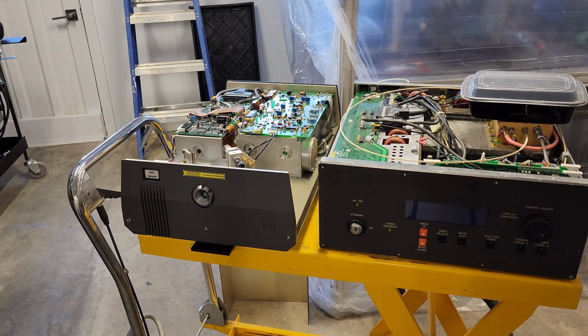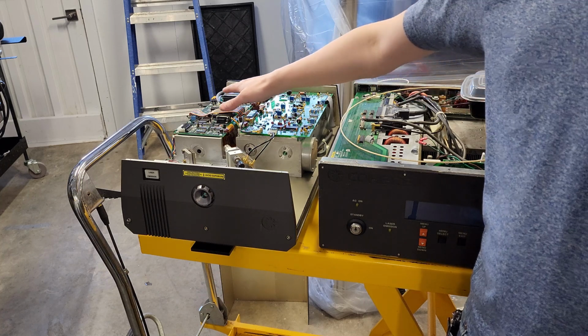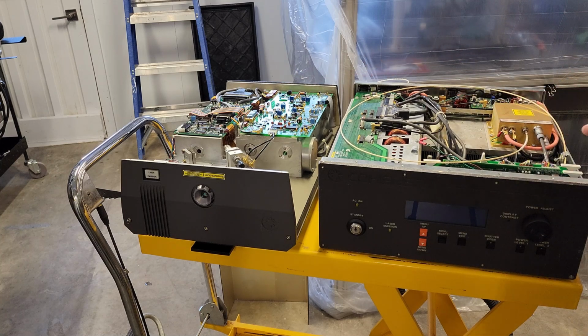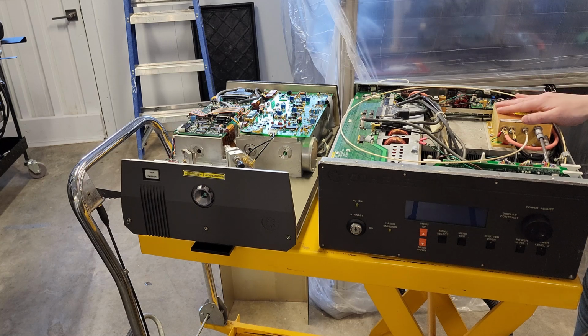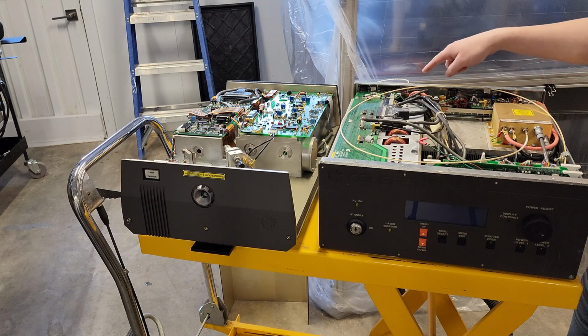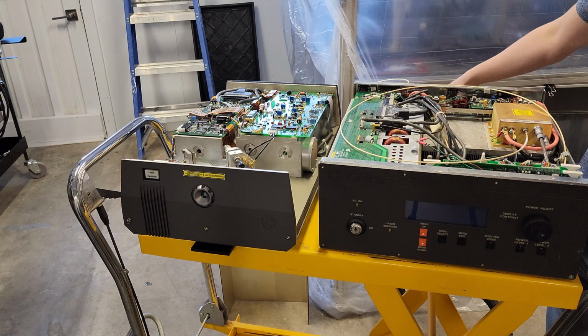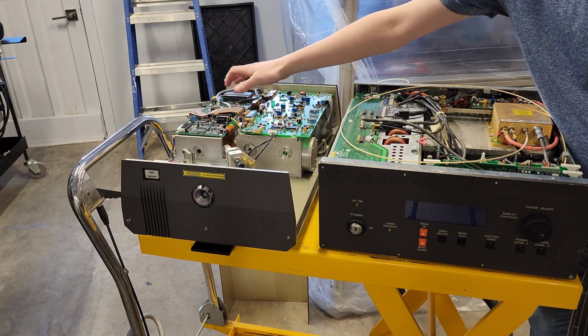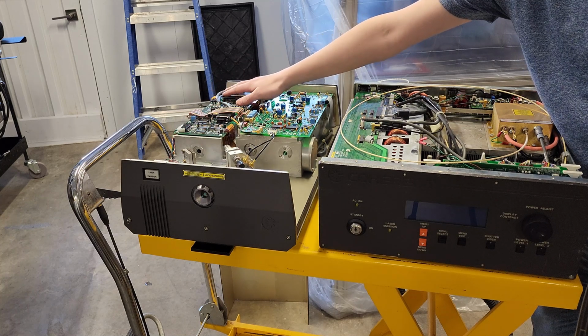When I was talking about what each component does, this here is the green laser. Infrared light comes from this laser diode. It's around 808 nanometers, somewhere in between there. That light is coupled into this optical fiber through here, goes through the umbilical, comes up through the umbilical on this side, into this laser, which is the metal box below here.